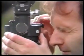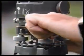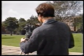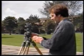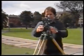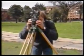The next stage is to center the instrument exactly over the top of the nail which forms the station. Looking through the optical plummet, you can see an index mark which must go over the nail. Undo the centering clamp and slide the instrument until the index mark is exactly over the nail, then tighten the clamp. Unfortunately, the act of centering can upset the leveling, so you must check it once more. The full procedure isn't necessary since you now know where the bubble should be for the instrument to be level. Once you've rechecked the leveling, check the centering again, since re-leveling can upset the centering. However, you usually only need to do this once.